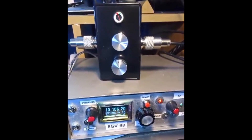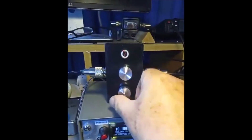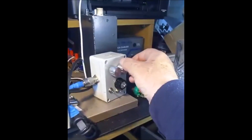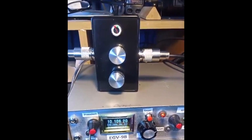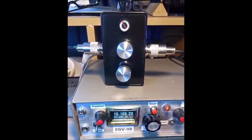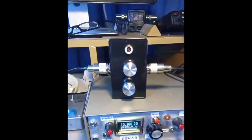Now I'm going to go through the ATU and adjust for better SWR. We'll go through the procedure again — position 1, we've got full scale deflection. Position 2 shows the relative SWR and you can see it's about half scale. I'm going to adjust the ATU now — I've already preset it just for this. As I adjust it, the deflection goes down to zero. So that's the ATU set for best SWR, and when I'm happy with that I switch to position 3 which isolates the bridge totally.